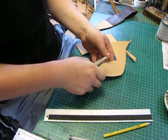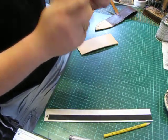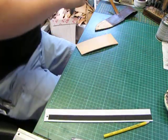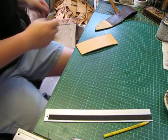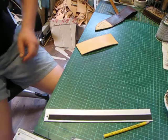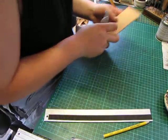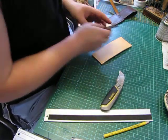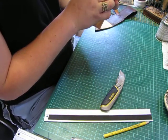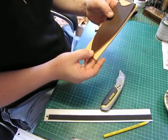Very, very slightly oversized. We'll just chop that bit of waste out from the inside. Pop that there because we'll probably be needing that again when we come to do the other little bits. Normally you only have to take one complete welt out, and then the rest will be pieces down the sides for the feathering. So we'll just double check that again now, make sure I've not gone too short. It's pointless cutting it out if I have, which I haven't.